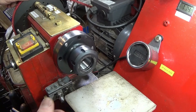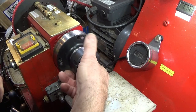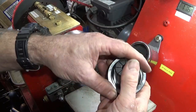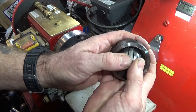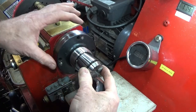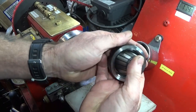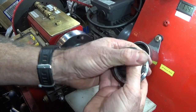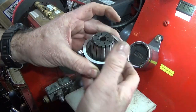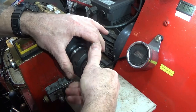If you're new to collet chucks, remember you've got to take the nut off first, put the collet in the nut and push it home. Many people when they first get a collet chuck don't know this — they think you can put the collet straight into the chuck and then screw it on. You've got to push it in at an angle until it clips into place; when it clips into place you can see it won't fall out, and then you screw that onto the collet chuck.